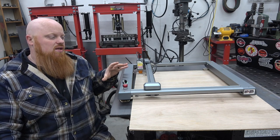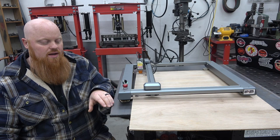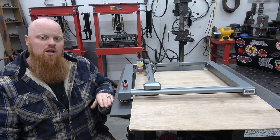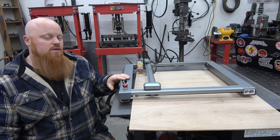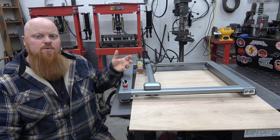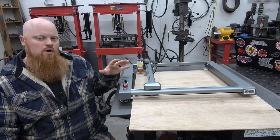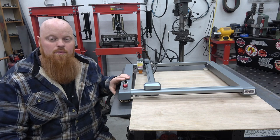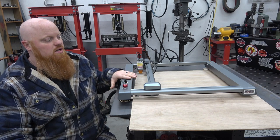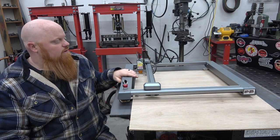I'm using it right out of the box with no honeycomb bed. You do want to protect your work surface — I have an eighth inch piece of steel on my weld table so if the laser shoots through the material it won't damage the coating. A 10 watt laser is stronger than you think and could definitely hurt you. It comes with a little shield and a pair of glasses to protect your eyes from harmful rays, and I always wear those glasses. I'm also planning to buy the air assist, honeycomb bed, and enclosure because we grind a lot of steel here and I don't want metal dust getting in the tracks.